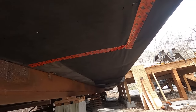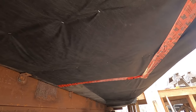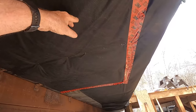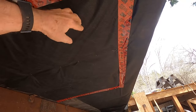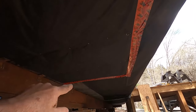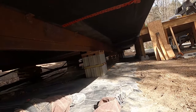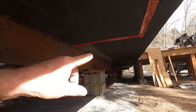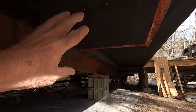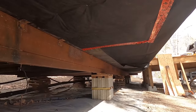I've got a little bit more to do down there — I ran out of tape so I'll get some more, but you get the idea. The main thing with this is to hold the insulation up so it doesn't fall out, and also to keep varmints out. If you have your underbelly tight, it discourages rodents. I mean, they can still get in by chewing through it, but the neater and tighter and tidier you have things underneath, the better off it is keeping the environment out.